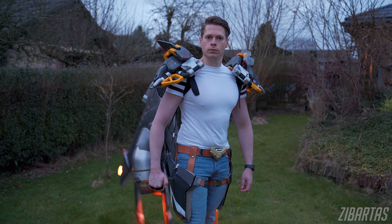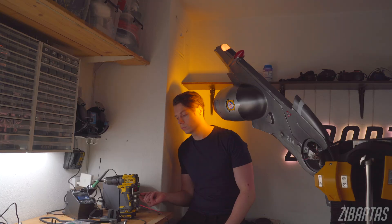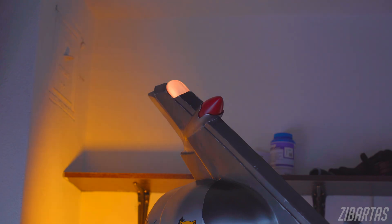However, all the BMS boards that I tried somehow were bottlenecking the battery, to the point where the motors did not get enough current to lift up the wings anymore. So to get these massive wings moving as fast as they are, I'm powering the motors directly without bottlenecks, but to maintain safety, the battery is still being monitored. Once the voltage dips below a certain level — with a generous safety margin of course — the wingtip LEDs change color, indicating that it's time to change the battery.